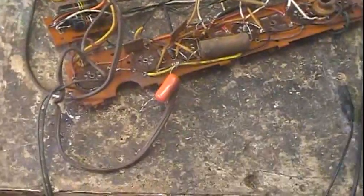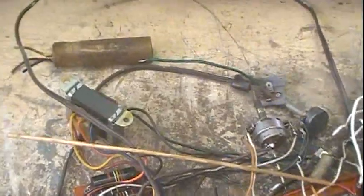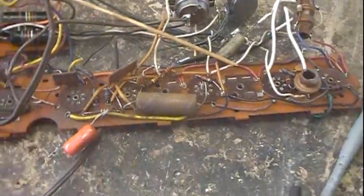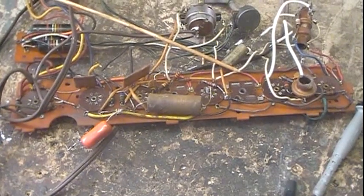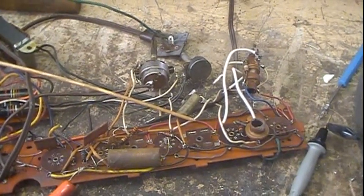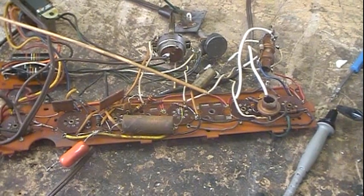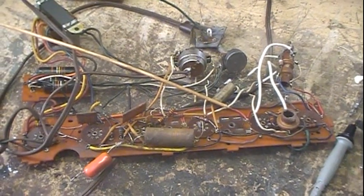So I hope that answered all the questions — what you guys had about checking resistance, where I hooked up on the radio, and dealing with the two grades of isolation transformers. I've got the radio torn down; I need to clean off some rust off the chassis, and getting it torn down makes it a little easier to get the wires unsoldered to replace components and get it cleaned up. It's a simple radio so it won't take long to go through it — I'll replace all the caps and anything out of tolerance as far as resistors, get her up to par, and shoot some stuff in the potentiometers to make sure they're nice, clean, and working right. Until the next video, thanks for watching. If there are any other questions I'll try to answer them — I'll see you guys in the next video. Have a good day, bye.